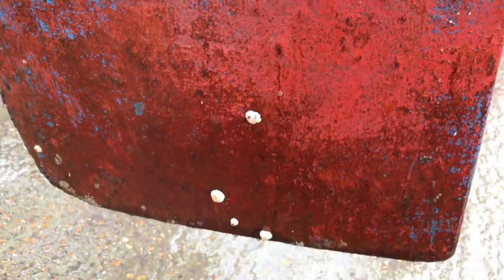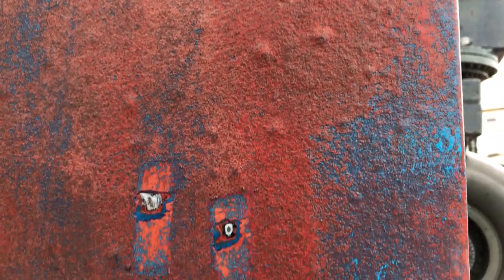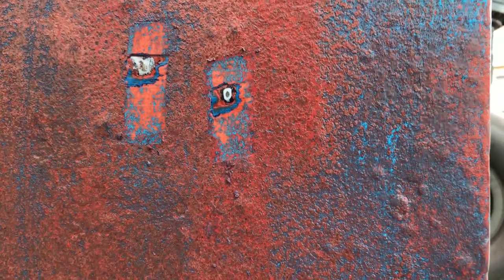It's not desirable and many people would walk away from this sort of thing, but many others will just live with it because it's not terminal — it will take years and years to affect the structure and strength of the rudder. Other people would have it treated: basically, take the rudder off, dry it out, sand it down, and put more gel coat on and more antifoul again.